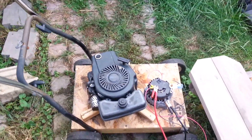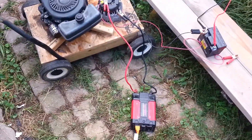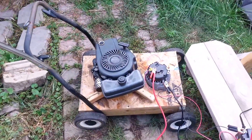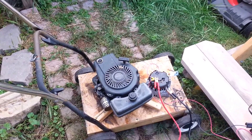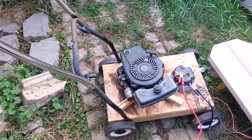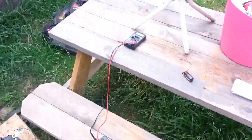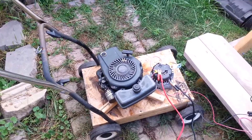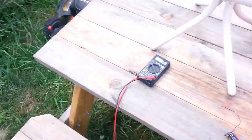Figured why not make something out of it. The wiring is not proper — little 12-volt battery, little Harbor Freight inverter. The only problem is if you try to put a big load on it, 400 watts, it'll stall the engine. That's probably because I don't have a heavy enough pulley on the end of it, so there's no inertia to keep it going. It does work, but it needs remounted — it's tearing up the mounts, and I don't like the vibration. Not bad for a first shot.